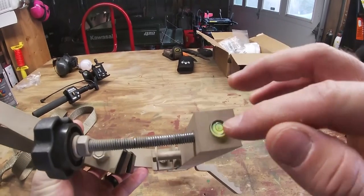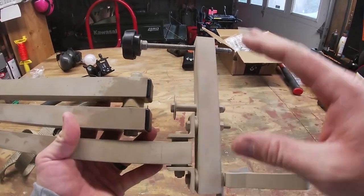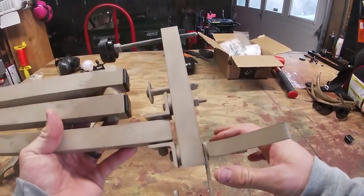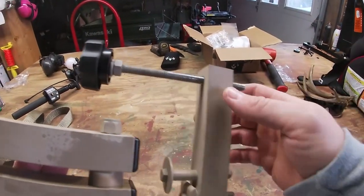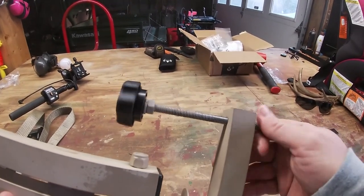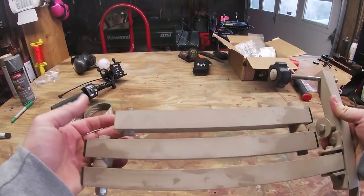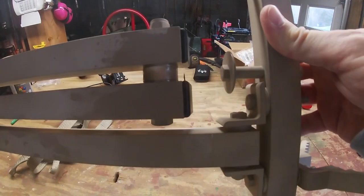These brackets here you can also get on Amazon. When you're drilling your holes, it's really important to use a drill press — there's absolutely no way you'll be able to drill the hole straight by hand. This part here is threaded; I ended up taking it to a machine shop in town and they did it for about five dollars — that's the only thing I had someone else do. The arm segments are 14 inches, 12 inches, and 10 and a half inches, and that's just so everything fits together nicely and gets clearance everywhere.